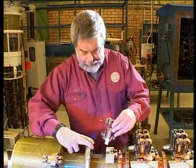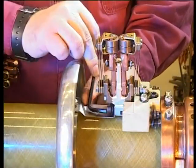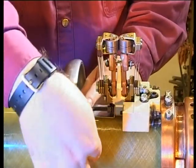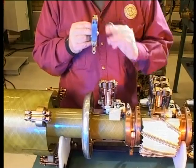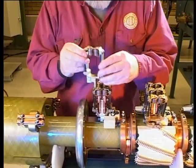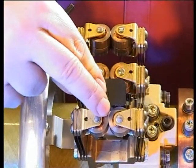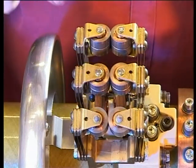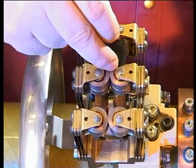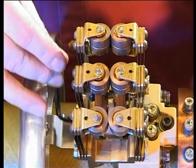The new main contact unit and the resistance contact units are then installed. Start with the main contact. Use a locating tool to ensure that the units with the resistance contacts are correctly positioned. Refer to appendix six of the maintenance guide to see what's correct for your unit. Tighten all screws referring to the guidelines set out in the maintenance guide.